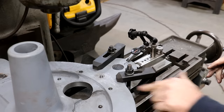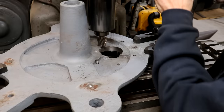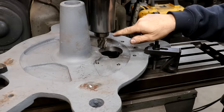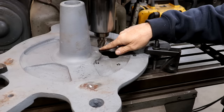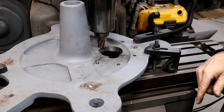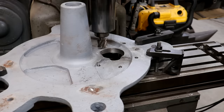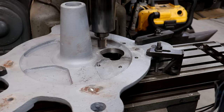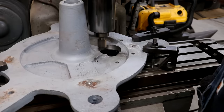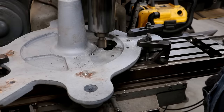I've got a fairly large diameter end mill here and I'm just going to come down and kind of touch off there. My challenge is that we've got to clean this up right up to that edge there without hitting in here. So I've got a larger diameter end mill to hopefully minimize that clearance issue. I'll get my phase converter turned on and we'll start doing some milling. I just kind of touched off there — I want to make this a real quick pass across here just to knock any high spots down. We're barely touching right in there.